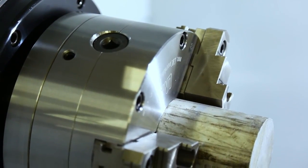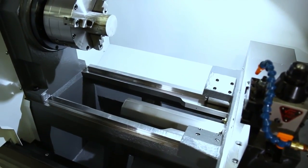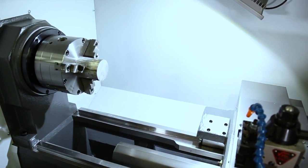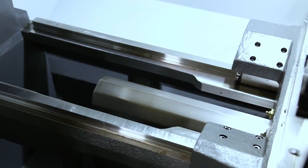So I can put an 8-inch chuck or a 10-inch chuck on there now — that's correct. But we didn't stop there. We completely redesigned the spindle cartridge, going from a 2-bearing design to a more rugged 3-bearing design, which is very similar to what you'll find on the ST turning centers. That's a huge improvement — the TL1 now has much more power, it's much more rigid because of the bearing design, and I've got higher accelerations and decelerations. All that ties in with a more rigid saddle.